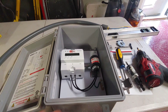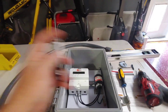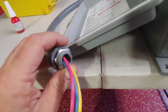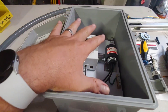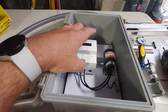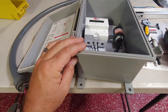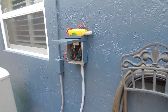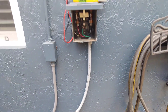I'm going to start by setting up the whip to this before mounting it on the wall. I've got a drill bit and I'm going to drill two holes in the bottom — one for line in and one for line out — and then seal them up so I don't get any critters in there. You typically get ants, bugs, spider webs, and wasps finding their way into electrical panels. Let me show you where I'm going to put it — that's my unit, that's my disconnect for the AC, and I'm going to put it right underneath.